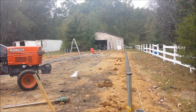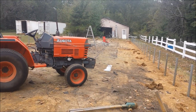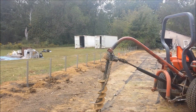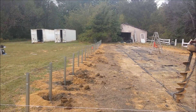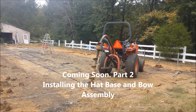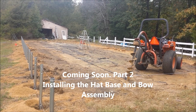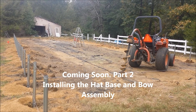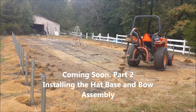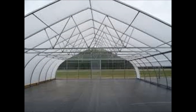Alright tubers, we've got it done. Each side, four feet apart, 38 inches down. I will correct that mark from earlier where I said it went down 32 inches — it's 38 inches down. All of the ground posts are in. All I've got to do now is concrete it and start setting up my structure. God bless y'all — planting some dirt — and what do we say? We'll see you next time. Take care y'all, bye.